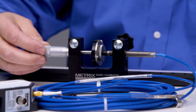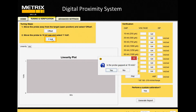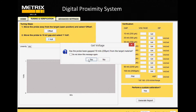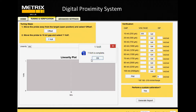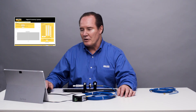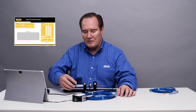I'm at zero — going ahead to 10 mils and doing the 1-volt check. The output will become 1 volt. I'm going to say do not show me the message again. It will fill in and we should start close to 1. Then we'll do 10 mil increments and demonstrate linearity. We've just adjusted for 1 volt, and now you can see it's very close — 0.999, which is very close. We'll adjust every 10 mils and check for linearity.